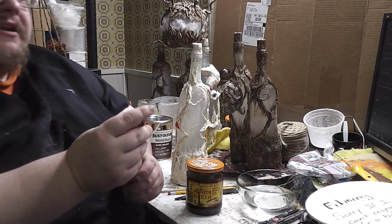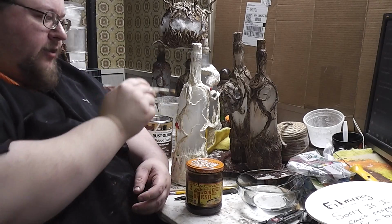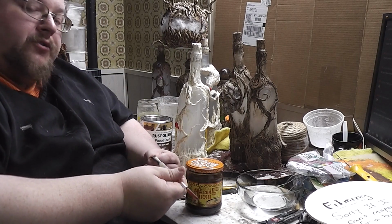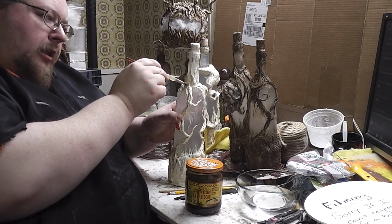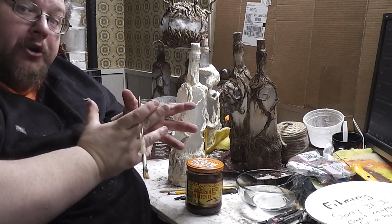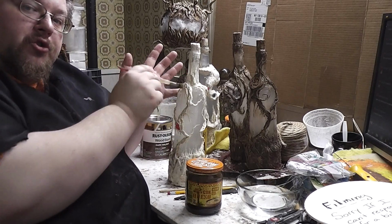When I stain, I like to use a nice, fairly soft bristled brush so that I can get down into cracked areas. As opposed to painting, when I'm trying to deliver and cover areas, with staining, particularly of this stuff, I find what I'm really trying to do is just dip my brush in the stain and then deliver that dollop of stain to the cotton witchwood here. The stain will then seep into it and spread of its own accord, so I don't really have to spread it myself. I'm just trying to deliver large dollops to the project.